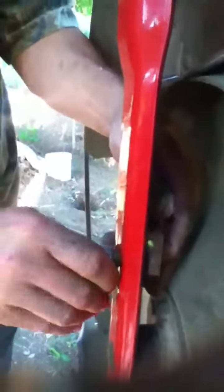It's just going to need some adjustment — the front of my deck has been squeegeed out a little bit, but I'll show you how to fix that. If your deck bends, take your crescent wrench and just bend her right back out. Be careful and don't be hitting those stumps with it like I do — I'm pretty bad to bush hog with mine.